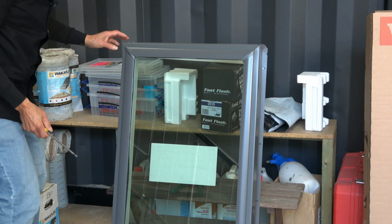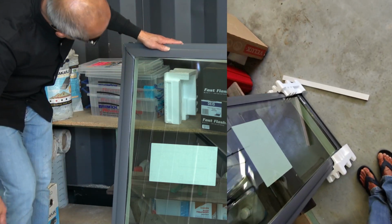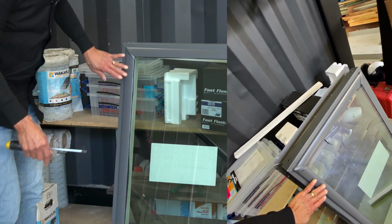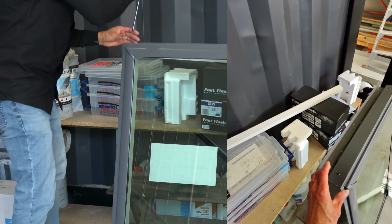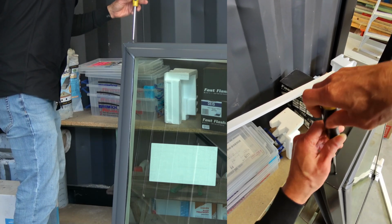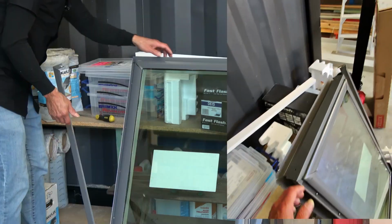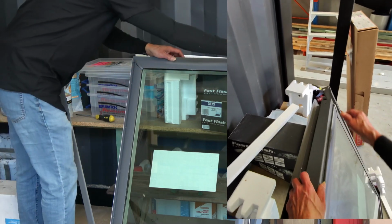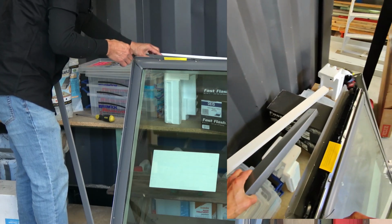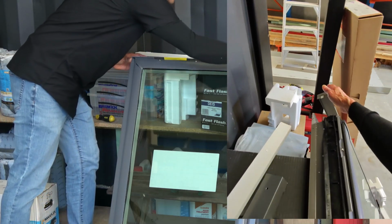It's important to note that these skylights have an upstream end and a downstream end. That's the downstream end. You notice it's different to the upstream end. The detail is different. We'll have to look at the bottom end because the bottom end is the more important end, and this is where a lot of people go wrong. If you take the screws off, we'll take this flashing out. Right, now the 3 flashings are out, and there's a couple of important things to note here.